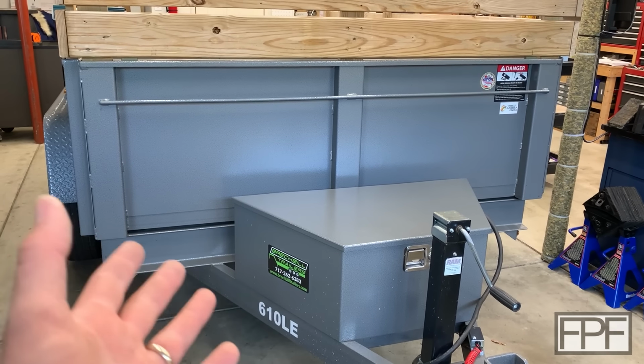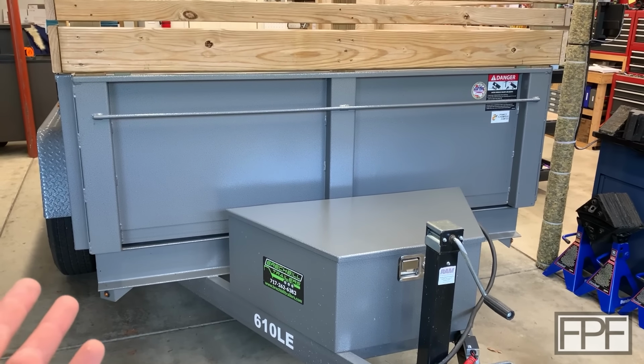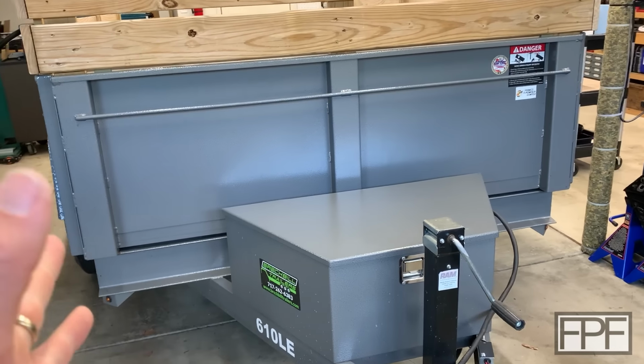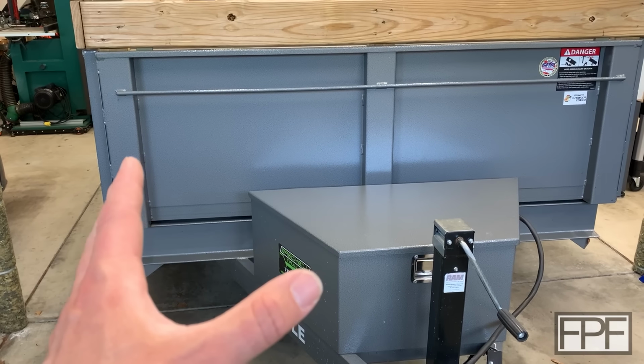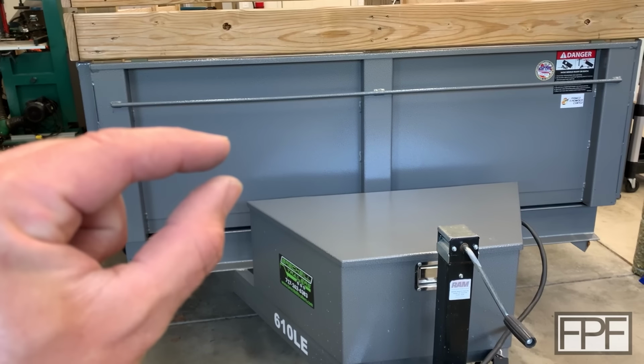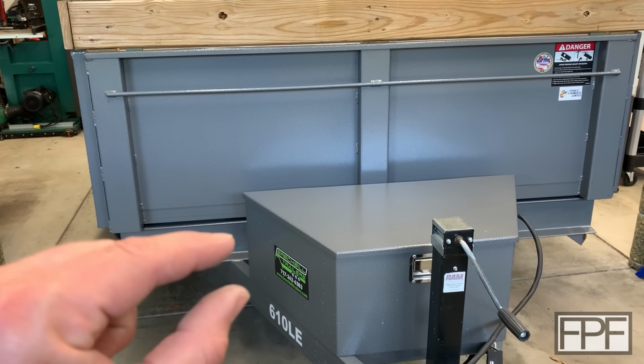I'm sure those things are used in all sorts of, not just trailers, but other pieces where a rubber bumper like that is required. Just remember, to get the full function of the design, you're going to need to make those modifications in the slicer as well, so it's softer on the top and stiffer on the bottom.